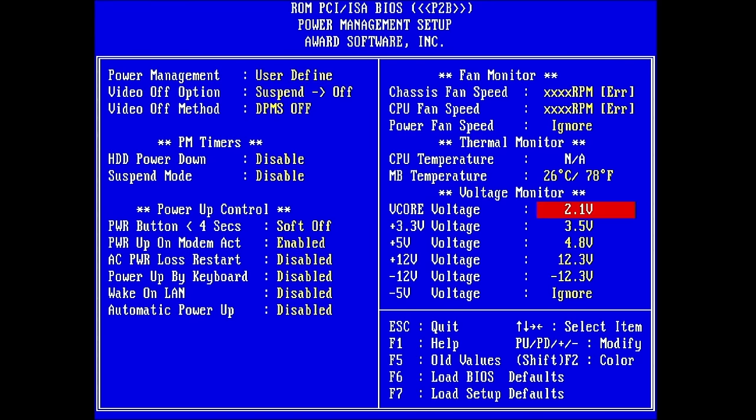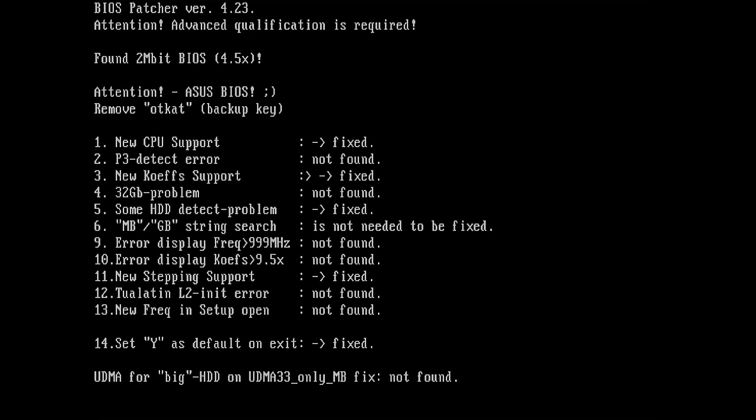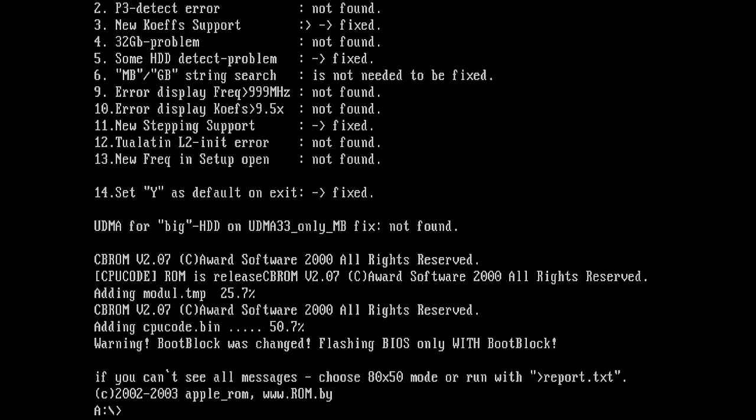But there is something else we can do to get an even better version of this BIOS. With BIOS Patcher, we can enhance the capabilities of the BIOS, add support for more CPUs, and fix a few bugs along the way. If you want to learn more about this little tool, there is a video about BIOS Patcher on my channel. Every P2B I can fix will get this BIOS. Once BIOS Patcher finished patching the BIOS, we can flash it once more to the board using UniFlash.